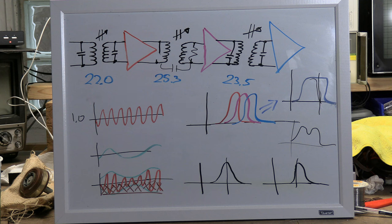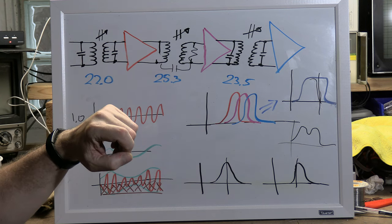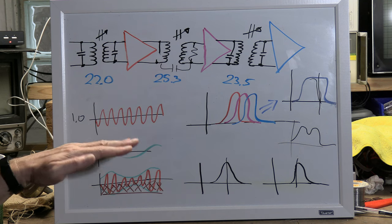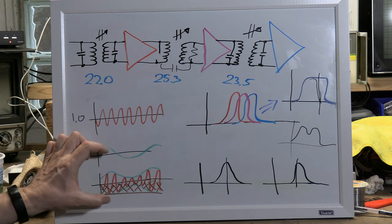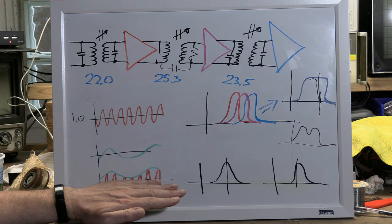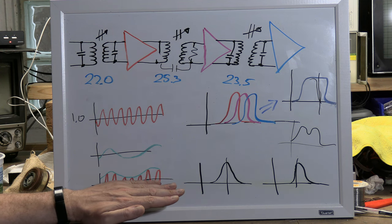Now something else I wanted to throw in here. You may have heard the term sideband, single sideband, lower sideband, upper sideband, vestigial sideband. The video information in television is amplitude modulated. So just like this diagram I showed you, you've got your carrier, you've got your modulation. Instead of sound, it's going to be video. It's going to be light and dark. The modulation is symmetrical. There's a technique you can use where, and this is not technically how it works, but conceptually I think you can get it.